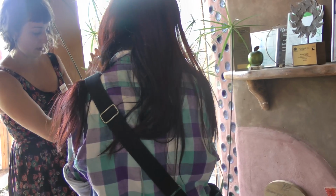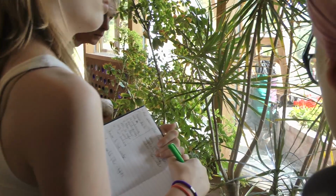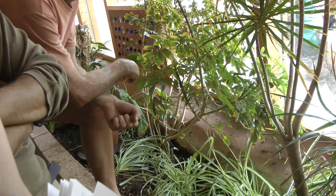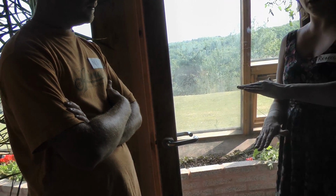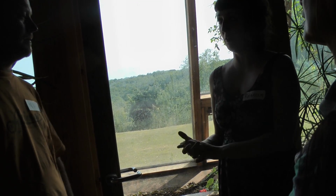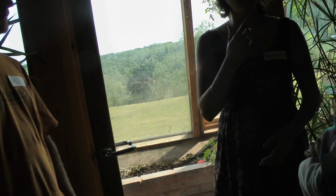So it goes through the holes, and then all this along here loops round to be connected to this planter there underneath the entrance, and moves to that end there. And what you've got under here is essentially a lined ditch with gravel at the bottom, and then sand, and then topsoil on it. And the sand stops the topsoil going into the gravel and clogging it up. And again, it's biological treatment. It's in the book? This is in your book, yeah.